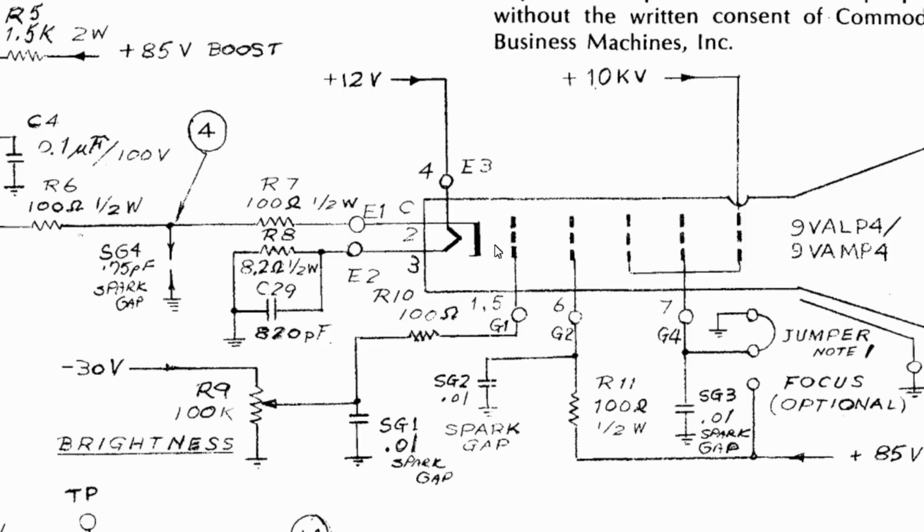And the longer this is at minus 30 volts, the more resistance there is right here at G1 from allowing electrons to flow past it to the front of the screen. And that's what we're trying to do here. We're trying to prevent the electrons from being shed from this cathode when it's grounded and flying towards the front of the screen. Now the heater, which is this part right here, is heated by 12 volts. That warms up the cathode and allows it to shed those electrons. As the cathode cools though, it loses that ability.